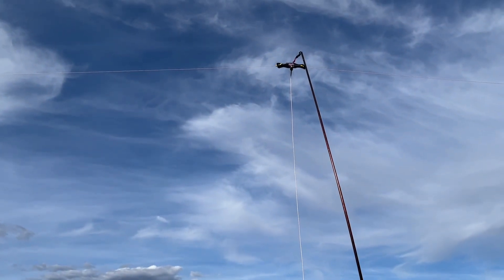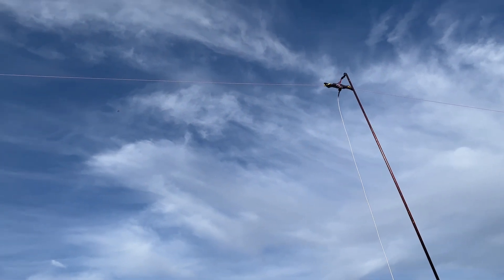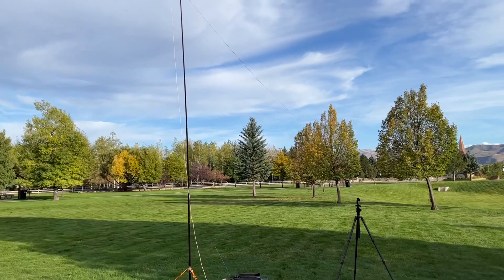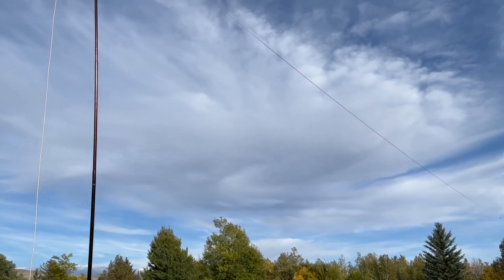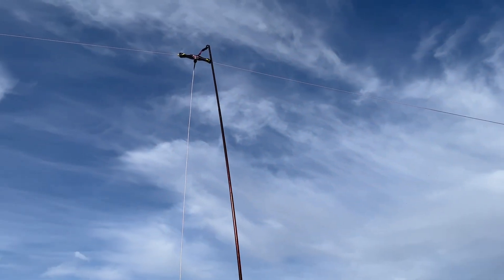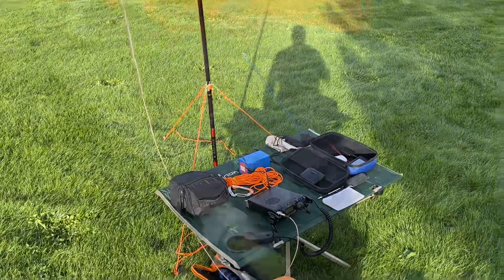Some of you have seen this before. Here's the setup: this is about a 15-foot run of RG316 coaxial cable connected up to my DIY NVIS antenna. This is a 40-80 meter linked dipole, and I've got it connected to another tree out there. The feed point is about 13 feet off the ground, and the antenna averages probably a little less than that for 40 meters. For 80 meters, it sits about 10 feet off the ground with the feed point still at 13 feet. I designed this antenna specifically for this deployment and it has so far worked very well.